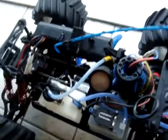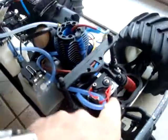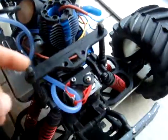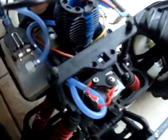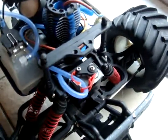You've already got the easy starter, you've got the battery. You do need a cutout switch. A magnet's useful if you want to use a magnet to hold the switch down. And of course here you're just needing an extra servo, a Y connector for your servo, some extra long fuel line, which I just happen to have anyway because I had this extra JATO fuel tank. And so yeah, you've basically got everything you need.